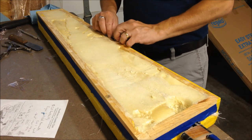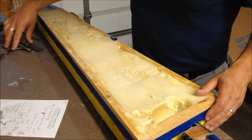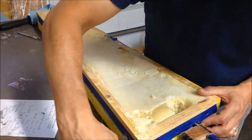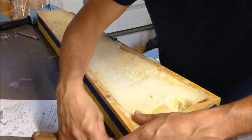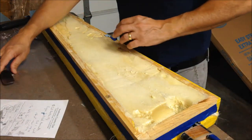Time for the de-molding. I confess I've already de-molded it, so I'm really just going to show you what it looks like. I had to come around the edges here and release all of it with a putty knife, being careful not to scratch the mold and also not to cut the fibers. I've got about an inch of clearance around before I get to the part itself.